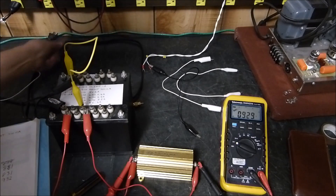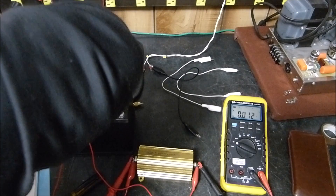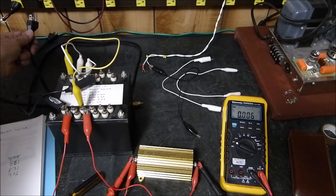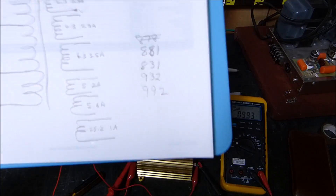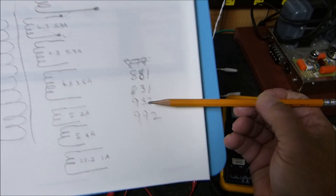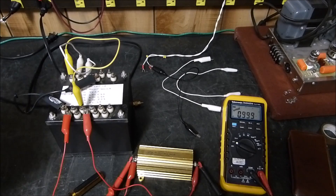Now if that's not cool enough, we can keep series-ing these things. Let's jump this one over and put these two in series — let's put another six volt winding in series. Now I'm using two of them. I've got them in series and out of phase — it's actually going to boost again. Nine ninety-two! So our original voltage was 881, I dropped it to 831, reversed the phase and got 932, now I've got 992 — up to almost a thousand volts.